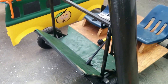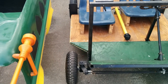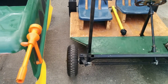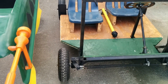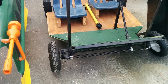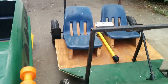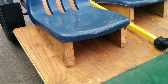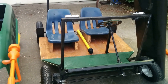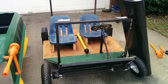Some stuff I learned during the race: our wheels were good but they could have been thinner. The fastest times down the hill were soapbox cars with solid wheels. Some of the solid wheels, though, totally crumpled in the jump — Sweetwater landed on their back wheel and it just crumpled; they were going very fast and doing very well. So if you go with more solid wheels, make sure you have some kind of suspension. The suspension doesn't have to be frame suspension — it could be on the seats. Since the frame is only 176 pounds and the two passengers are actually the most weight, you could make suspension on the seats to give a little cushion on the jump landing.